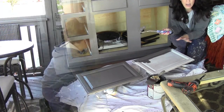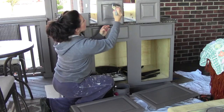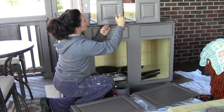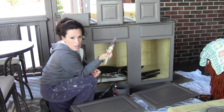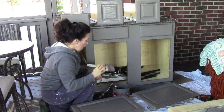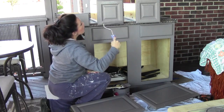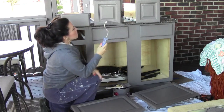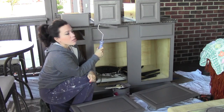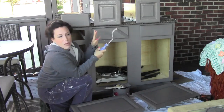I'm on to the third and final coat for the cabinets, doing it exactly the same way as the second coat — making sure I'm getting into all the nooks and crannies and covering everything nicely with paint. This is about a medium coat; I neaten it up slightly and then go back with a dry roller. The roller is only being used to texturize — you're not applying paint with it. The first coat dried to a really nice sheen; I love the satin paint. Note that for a kitchen cabinet, greasy fingers may not hold up well with satin alone.